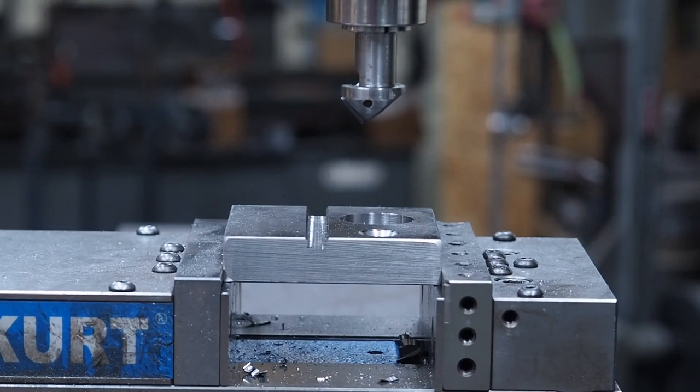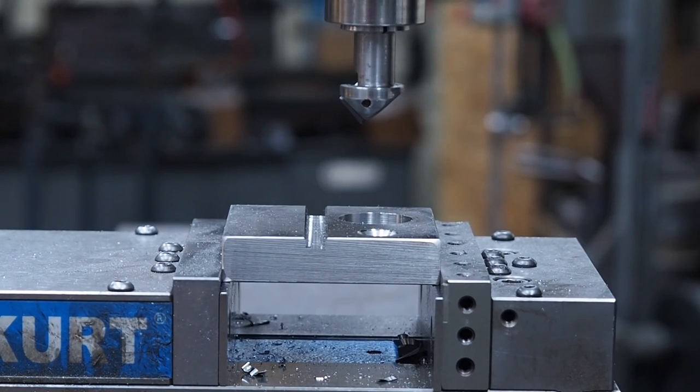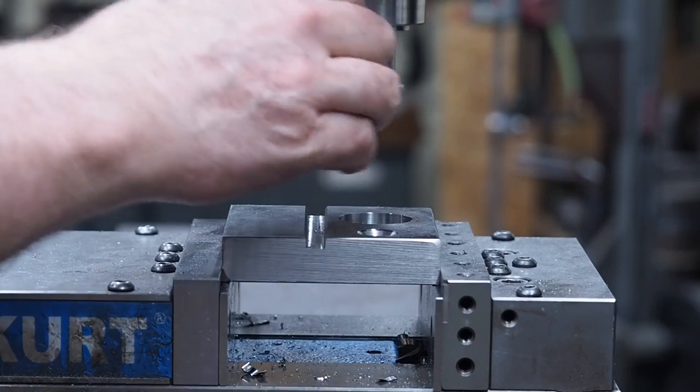It's leaving a super finish, one of the best I've seen in cold roll. And that one's cutting 1 inch 250 right on the nose. Maybe 2/10 over. 1.250 and 2/10, so that's good. What I'm going to do next, real quick.